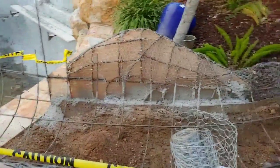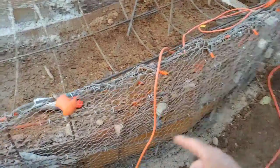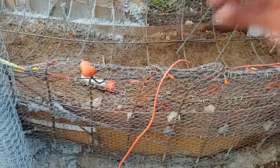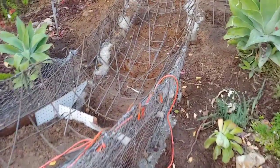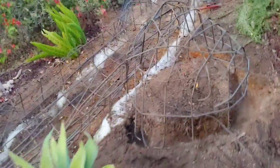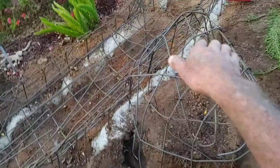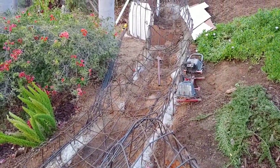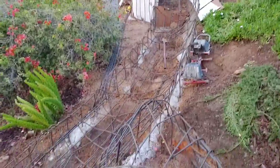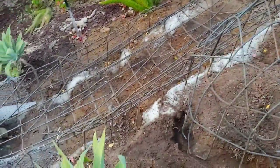On the slides, a lot of times we use burlap on the inside and pegboard where we need it. This allowed us to backfill all the extra soil and dirt created by cutting out our notches in the hill. We make steps first, which gives us a chance to walk around. We dig down little stair steps all the way along the sides, and I do my five-foot rebar uprights along those areas, then bend them down.